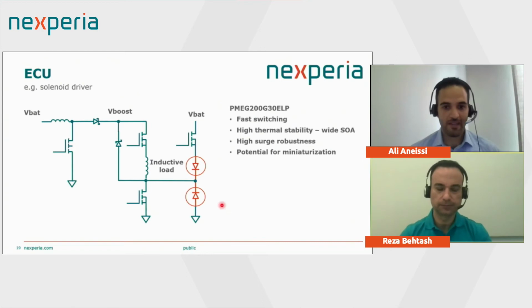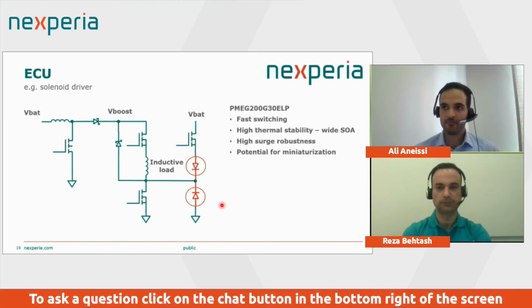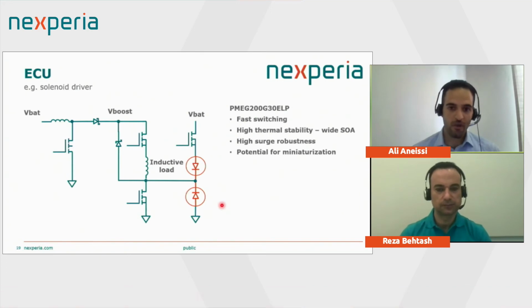So we tested also the PN diodes and compared the SiGe with other PN diodes in a comparable range. This is something we did in the comprehensive analysis we did in the project. Like I said, it was way more than switching performance that we tested. And the results that we have in terms of thermal behavior, it really depends from what angle you look at it or what application you are in. For example, in the DC-DC operation that we had, due to the higher switching losses that the PN diodes have, we reached a thermal runaway pretty quick by increasing the frequency for the PN diodes, while the SiGe diode could still compete with Schottky diodes and be stable, where you normally think that PN diodes would be the choice to pick for high thermal strains.